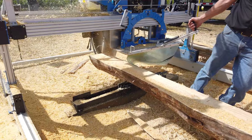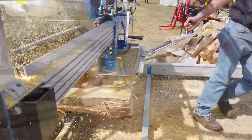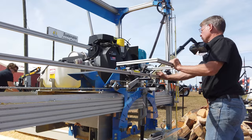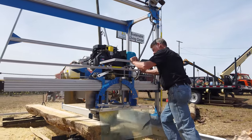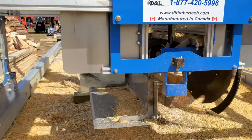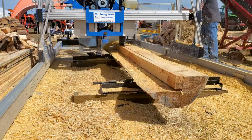The next on the list is what they call a swing blade circular saw. It swings both left and right, and it's a really fast saw for making dimensional lumber. However, it's limited in how big a timber it can cut by the dimension of the blade. This is one of the reasons it is not really great for slabbing or trying to make big timbers. That said, I don't think there's any sawmill faster at making dimensional lumber. It is not as portable as a wheeled bandsaw mill, but it still can be torn down and set up fairly quickly.